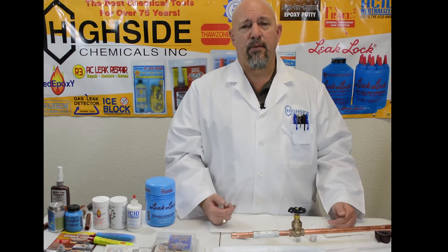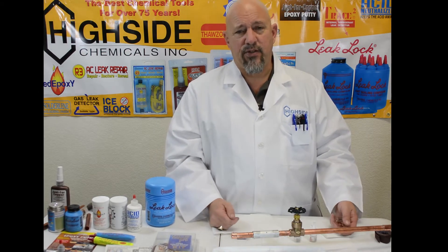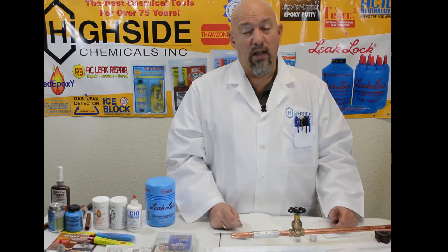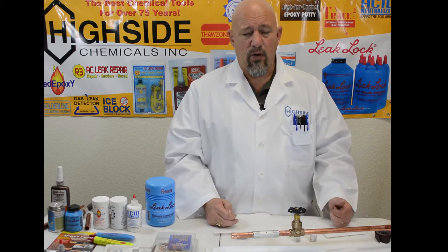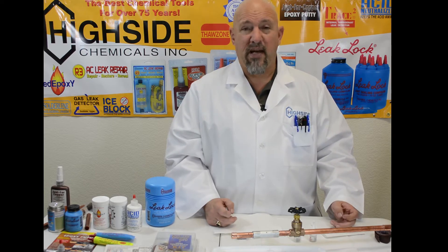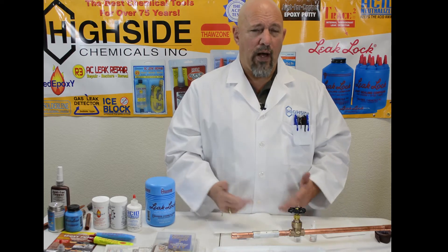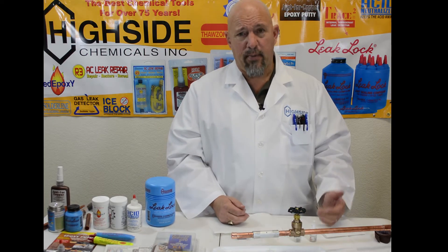What happens is you're actually putting heat on aluminum, which makes it susceptible to heat stress fractures, as well as making it an expensive and very difficult repair. Aluminum melts at about 1200 to 1400 degrees and the lowest melting solder on the market right now is about 750. So you're taking the risk of having a blowout while trying to repair the product and creating a bigger problem.